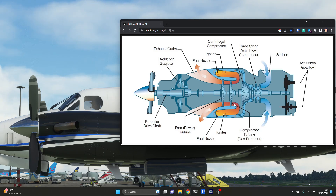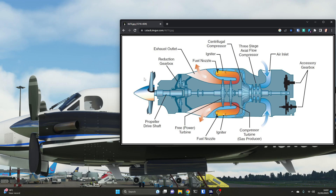The interesting thing then is the exhaust gas from the gas turbine pushes a separate axle, which is the free power turbine. This runs at incredible speed with the hot compressed air coming off the gas turbine — so it's essentially windmilling. At the end of its axle is a gearbox which drives the propeller. So in a nutshell, your turboprop engine: the hot air leaving the gas turbine engine drives a windmill with a gearbox to the propeller.